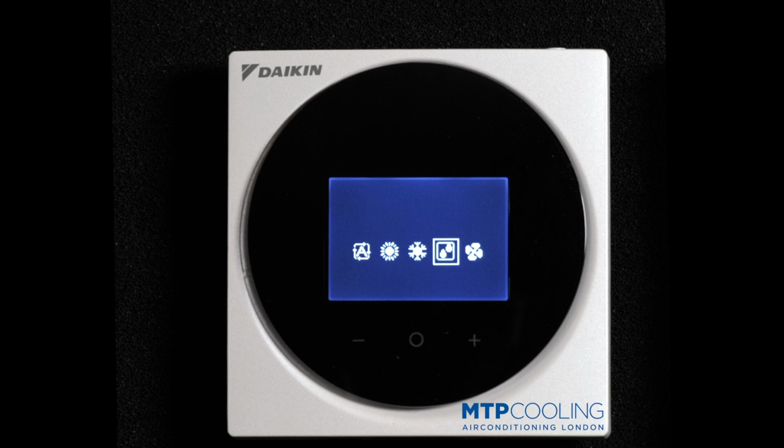This mode is pretty much in every air conditioning unit, and it is generally underused for several reasons. Many people don't understand the purpose of the dehumidifier mode, but it can improve indoor comfort by reducing humidity without overcooling. Some users associate comfort primarily with cooler temperatures and don't realize that reducing humidity can achieve similar or even better comfort levels without excessive cooling. In dehumidifier mode, the system prioritizes removing moisture rather than aggressively cooling the air. However, this slower cooling effect might seem less effective to those who want a quick temperature drop. Well, in this case, you would use just a cooling mode.